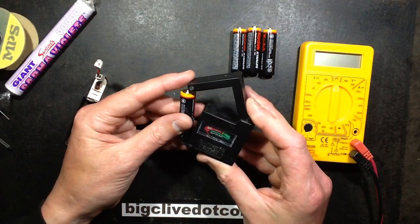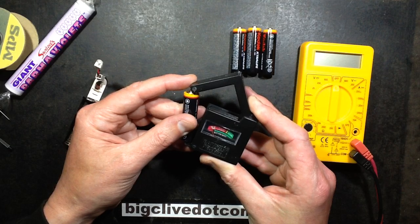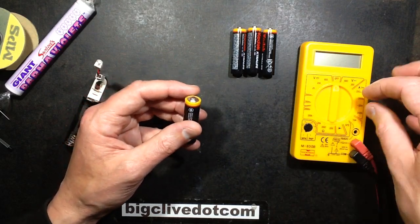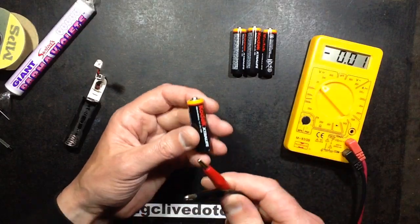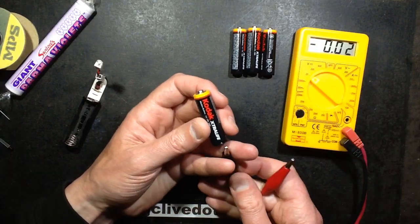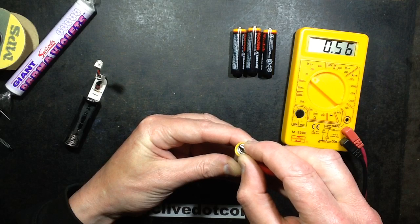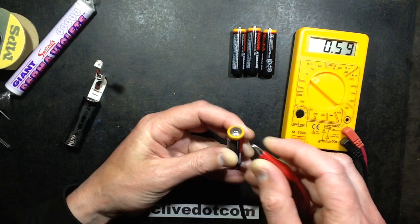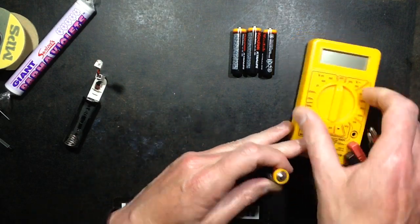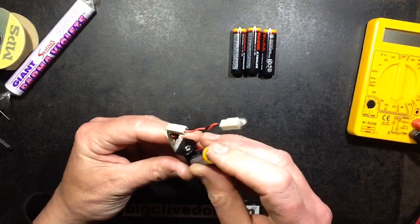This battery tester says it's way down at the bottom — it's in the red region. And if I measure the voltage using this little meter here, it says the battery voltage is 0.56 volts, just creeping up a wee bit again having been under load, so about 0.6 volts. As long as you've got 0.6 volts on a cell, you can kick-start this little circuit.